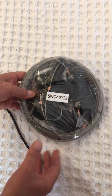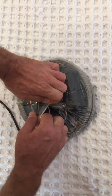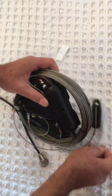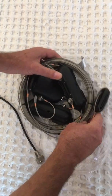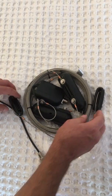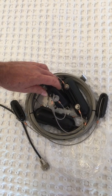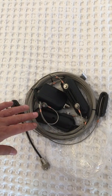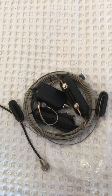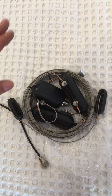So here we go, I'll just break the packaging. You'll see that the stainless steel wire is 304 stainless, which is fine even in salt environments such as close to oceans and the sea. We actually have these particular antennas which have been in situ for 15 years within 200 meters of the ocean and they're still working fine.